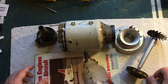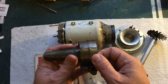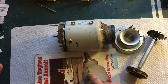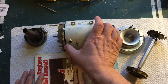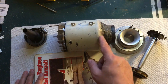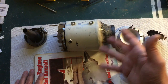The only thing I modified from the book is the way the outer can gets mounted. I just welded on a little clamp because the book uses little hooks and springs, and I just didn't like that — that's not going to affect anything. I also welded on mounting tabs; the book had different ones. And the outer can I changed — the book calls for a camping propane tank bottle, but I couldn't find one of the right dimensions, so I took a sheet of steel, rolled it, welded the seam, and beat the curve around. That's why it looks so beat up.